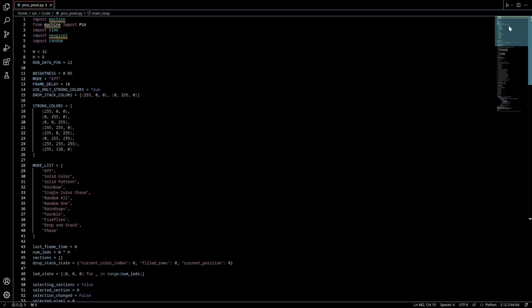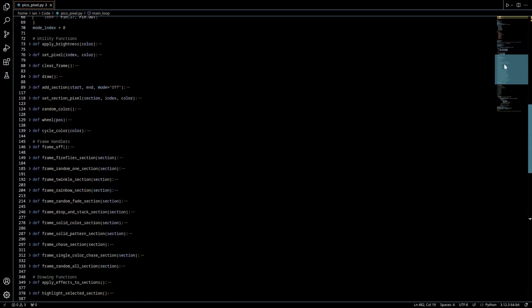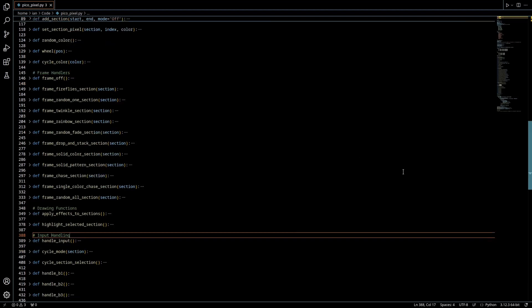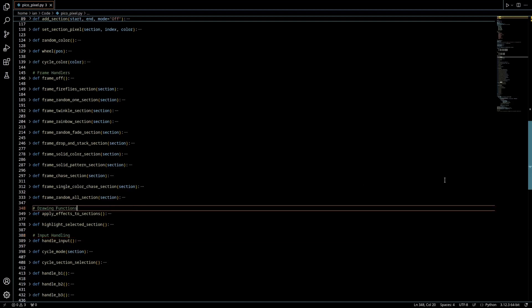Now the really fun part — making them do stuff. I'm not going to bore you with the specifics of the script, which I'll put on the GitHub with a link in the description. Instead, I'll explain how the script works and how each of the patterns I've developed works. In order to have smooth animation and be able to run more than one effect at a time, I created functions that figure out the state of the current animation frame rather than playing the entire effect. This also allows me to read input quickly without waiting between effects. The script figures out what all LEDs should be set to, then sets only the ones that have changed after all frame logic is done — very similar to the way a game loop works.